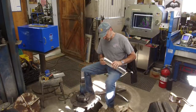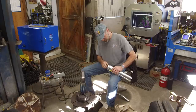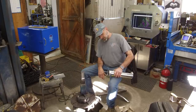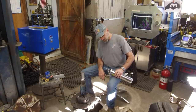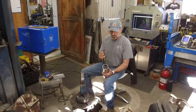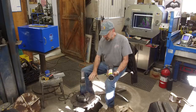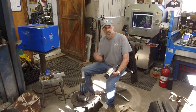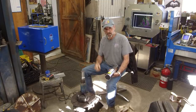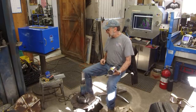All right, we'll go ahead and open this up, and those are some fatties. Okay, we're just going to pick the right temperature range, but we definitely have enough mass here to build that diameter up. So, picking the right voltage or amperage to burn this rod. I brought it down on the ground here because you have to be comfortable. I had it up on the stand, and standing and trying to control your arc is going to be a little more difficult than sitting here.